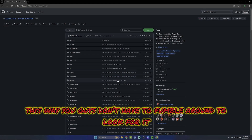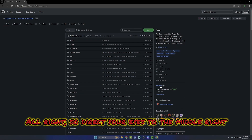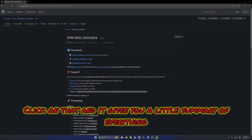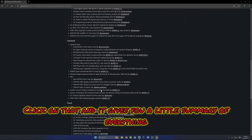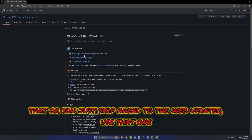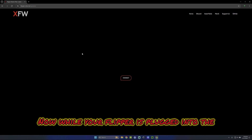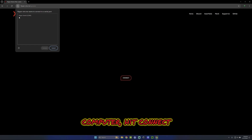I'll put the link in the description so you guys don't have to fumble around looking for it. Direct your eyes to the middle right where it says 'Releases' and click on that. It gives you a summary of everything that comes with this firmware. You can look at that or skip ahead to the web updater — use that one, it's the fastest way, no install necessary. While your Flipper is plugged into your computer, hit Connect and it should pop up.